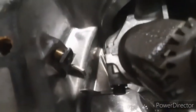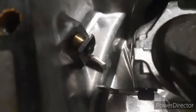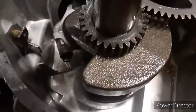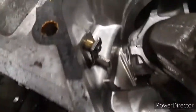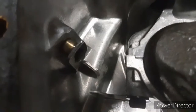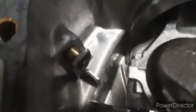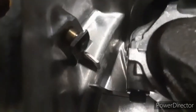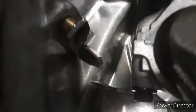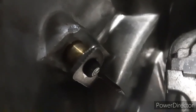That was just for a day trying to win the snowstorm over. But what we're going to try to do — now we have it apart, because you can't take it out unless you pull the crank. I don't want to do that. So we're going to try to do a little TIG weld around that rivet, try to keep that fixed. I'm sure there was a shear system so that if it's making a mess of itself it'll just shear off. But we're going to permanently affix that rivet onto that plate with weld.